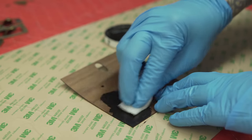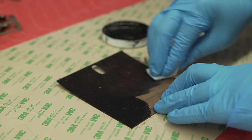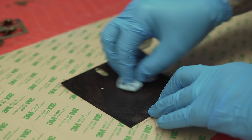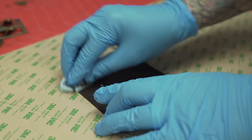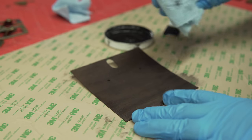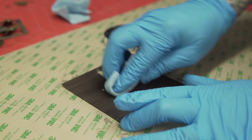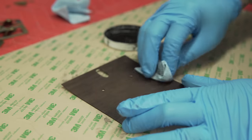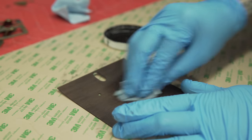This is going to look a little scary at first — don't be alarmed. This is the black wax. Not only is it going to deepen the color, but the real reason I wanted to use black wax is so I could buff parts of it off. Wax tends to set up fairly quickly so if you're working in circles make sure you smooth it out going back and forth. Once I have most of it off, I'm going to go really aggressively in the center, which will remove more wax there and give it a bit of an aged or worn look — right where someone's hand would have touched that spot a million times.